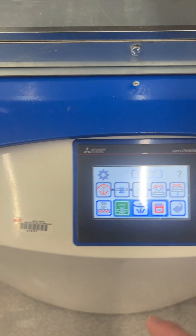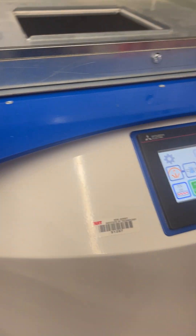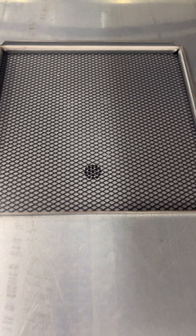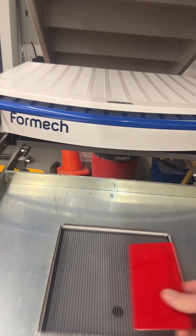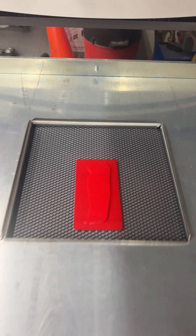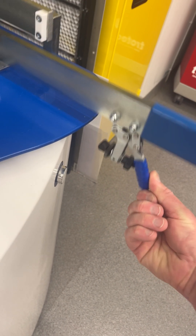To start, press the two buttons on either side to bring the table up. Once the table is at the top of the machine, find the tool that you made and place it on the table. Then open the frame on both sides.